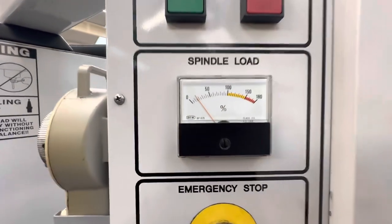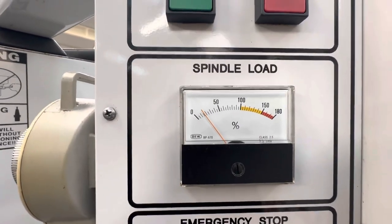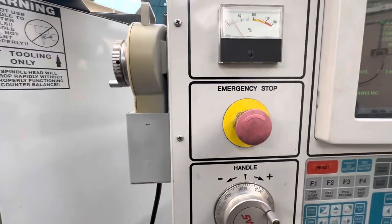I still think I've got the belt too tight because we're showing about 15% load there and it shouldn't be. I'm also getting a bit of tool sticking, so I'm going to check the tool release piston, the heights and the switches afterwards. We'll run this one for now